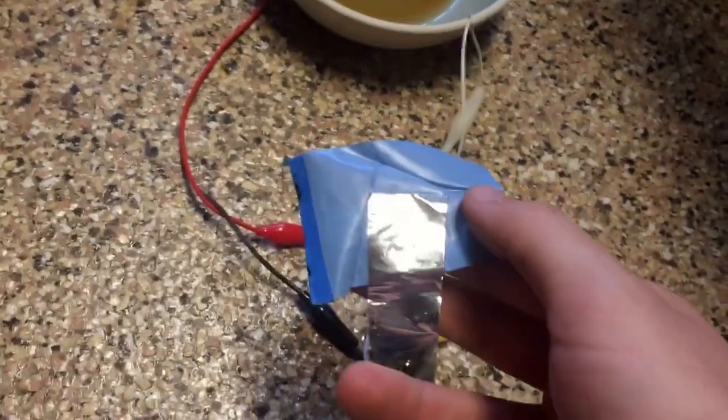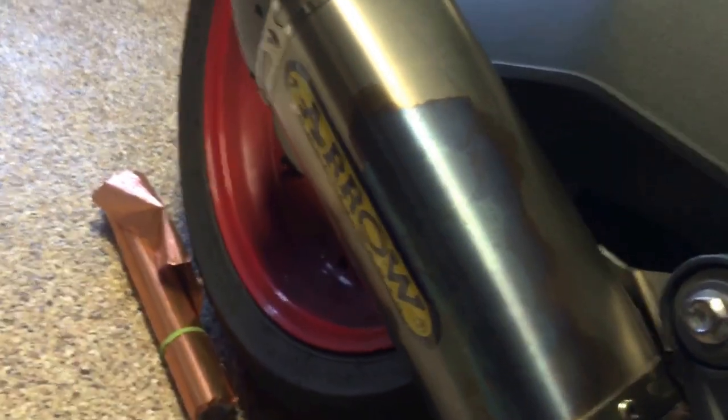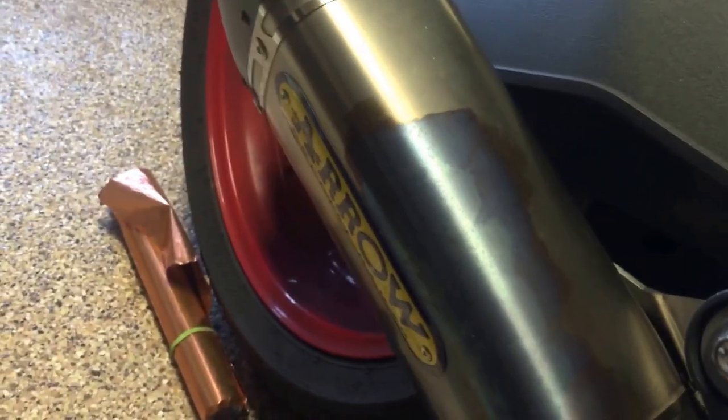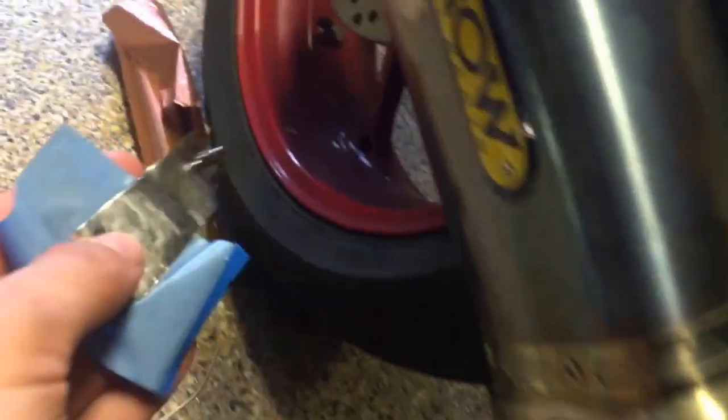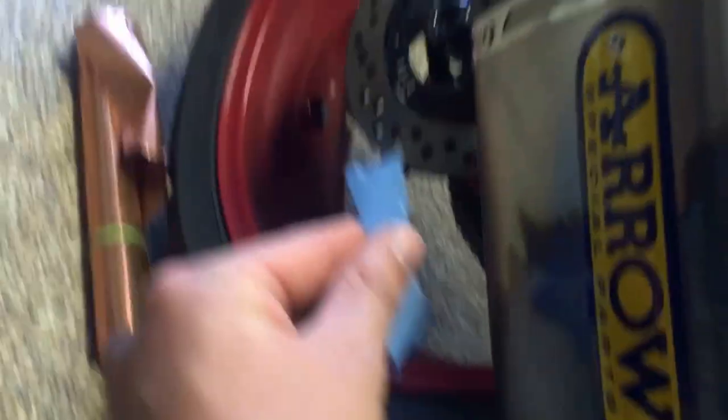Here I just have a piece of foil being firmly held to the exhaust with a piece of tape. It's important there's no gap between the foil and the exhaust — it needs to be really firmly put on there so there's no sparking. What that'll do is apply a positive potential to the exhaust titanium. The titanium conducts electricity, and you want it to conduct in the general vicinity of where you're trying to anodize at that time.